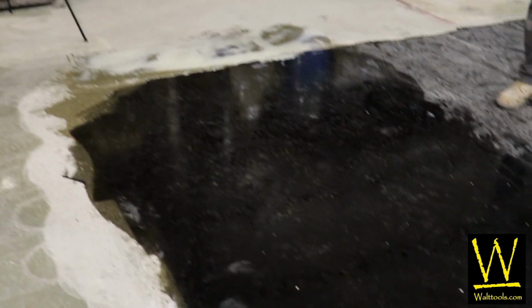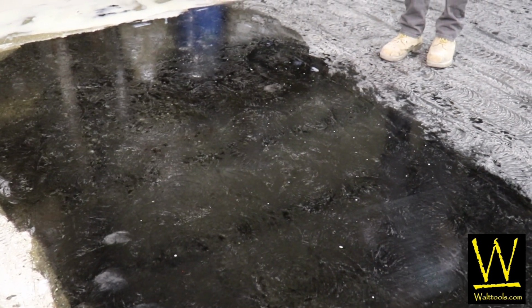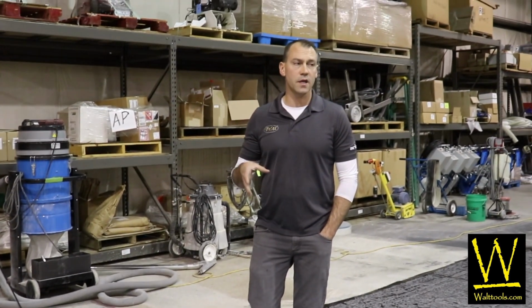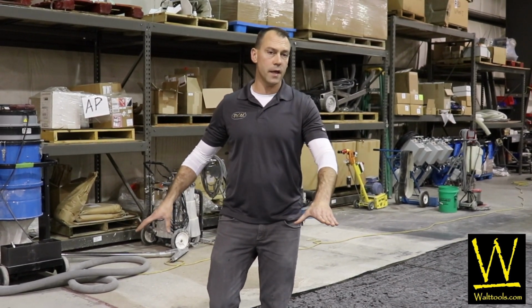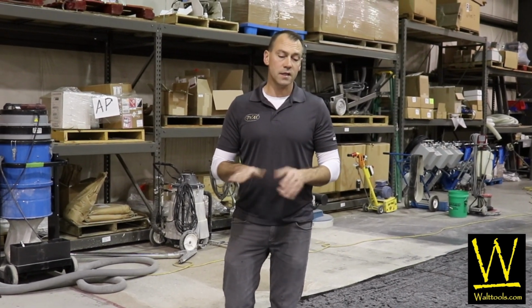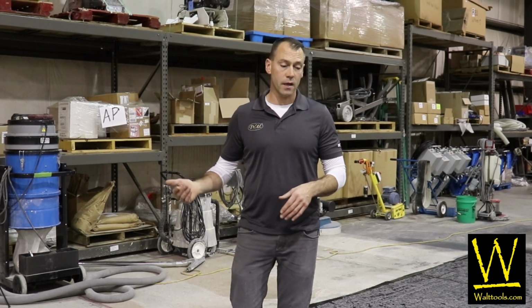Yeah, a little bit of practice, and you'll be able to figure out if you're doing sample boards, because it's a very attractive floor when it's done. But you can also make up sample boards with colors that are already known to work together, making that base slab a monochrome or a single color so there's no variation, and what that's going to take in material and time, and then also what quartz is going to work with that to complement it. So if there is incomplete coverage, you know the quartz is coordinated enough with the base color that it's not going to translate through. I did a white base the other day.